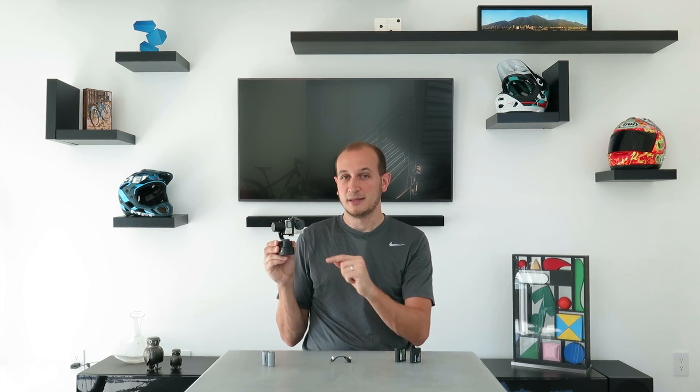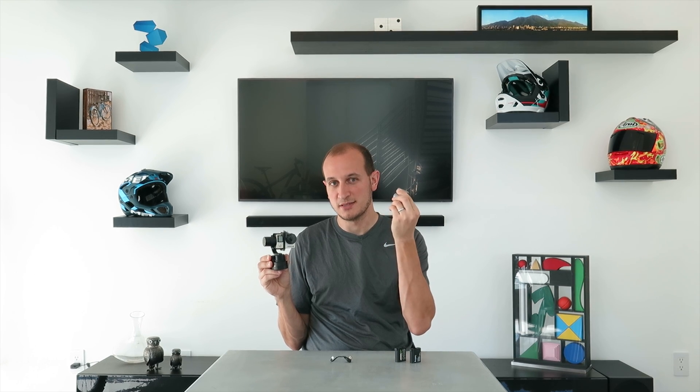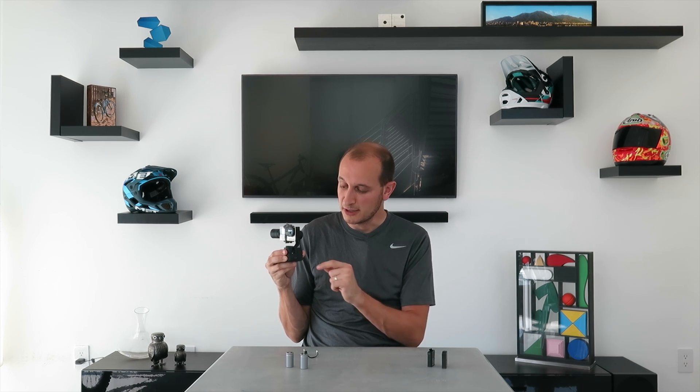Evo was super smart in building this little cable which allows you to power the GoPro from the gimbal. Unfortunately, when you're running the GoPro off the gimbal the battery doesn't last that much, which usually means that through one ride I have to change the gimbal batteries. There's a USB port here that we could run an external battery pack into, but unfortunately this USB port does not provide power to the gimbal, so we can't do that.